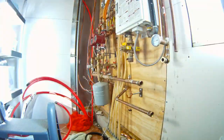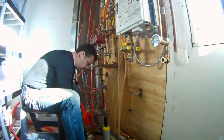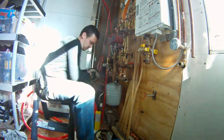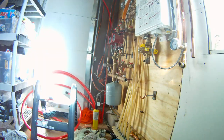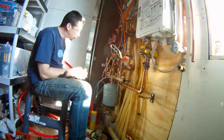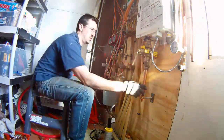I built this in 2009, basically the first fall and winter that I was in the house. What I just removed was the heat exchanger which allowed me to run domestic hot water and heat for the house with one heat source. That was great, but I have a lot of scale in my water. The tanked hot water heater would keep the scale at the bottom, but when I switched to the tankless heater the scale ended up in all my faucets and shower head and I was cleaning them once a week. I'd much rather flush the scale out of the tank once a year. You can get a water softener but I just hate the way that water feels.